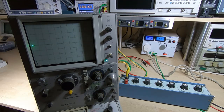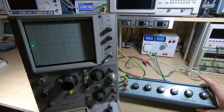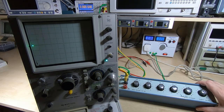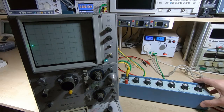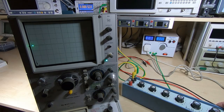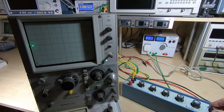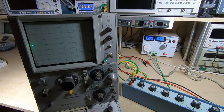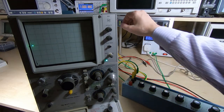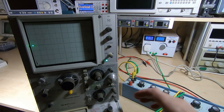For the next test step we need some precision resistors. Rather than keeping a whole range of precision resistors, I tend to use this precision resistance decade box. It's very nice, with very low drift. What I normally do is use it to select the exact resistance I want — it goes down to 0.1 ohms, so it's quite precise. It's currently connected to the Agilent and I can adjust it to give me the exact resistance I want. In this case I need a 1k resistor, and I can then transfer the resistance to the fixture — connecting it between the B and C terminals on the left hand part of the fixture. That's now connected, so I have a precise 1k resistor across the fixture.